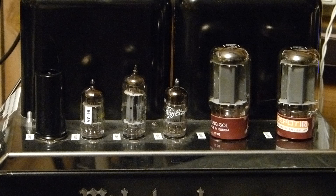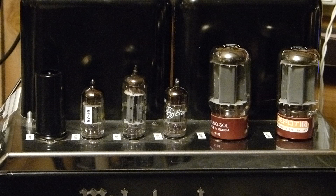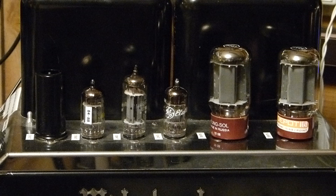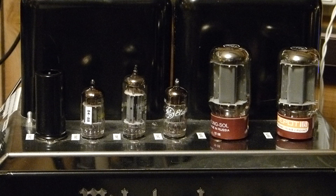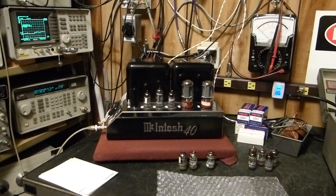Let's watch this thing. I'm going to turn it on. Here it goes. See, they flare up like a little light bulb in there. It's the wire right at the very end of the filament where it hooks onto the wire that goes out to the filament pin. Like I said, I already told you what I was told many long years ago why it did that. Those were the hi-fi tubes that everybody wanted back then, and I agree — you still want them today.